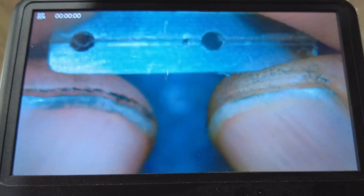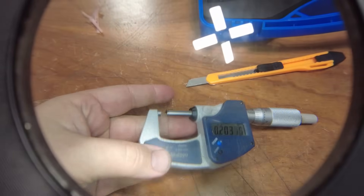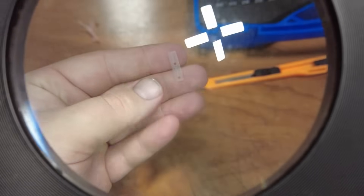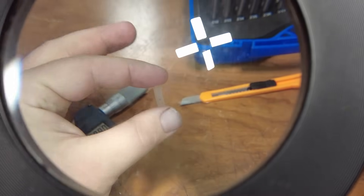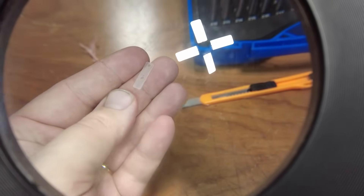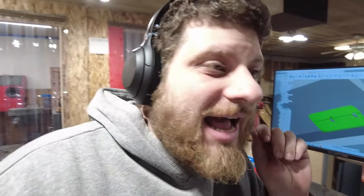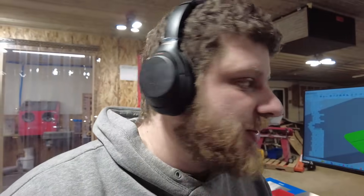The burrs do come off fairly nicely though. I wouldn't mind doing this for eight parts if I had to, but I assume when I get those speeds and feeds fixed we can get some of these burrs fixed. This is an interesting material — very springy. It's not like Ultem. I'm going to measure this and see what we come up with. This is the first good part of the second design, so I'm good to go to production. Basically, all I had to do to get that to work was to adjust some tool offsets and slow down my feed rate. For whatever reason, this plastic liked the slower feed rate better to get rid of some of those burrs. I am still going to have to do some hand deburring, but it won't be that bad. So at this point, I think I'm just going to go into production mode.